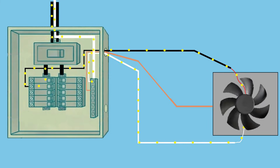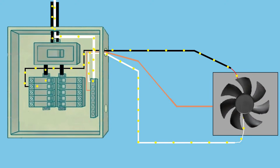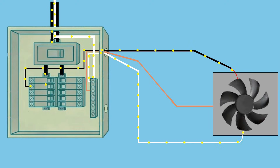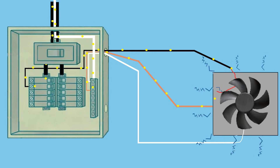Let's watch how this works. Here's a simplified electrical system — you have electricity flowing to this load, let's say it's a refrigerator. Right now everything's working just fine. But now a hot wire comes loose and touches the frame of the refrigerator. If someone walks up and touches the refrigerator, they could be electrocuted. Since the refrigerator is plugged into a grounded receptacle, the split second that that wire touches the frame of the refrigerator, a high surge of current will flow through the ground wire, causing the breaker to trip immediately. That's how the equipment grounding system protects people.